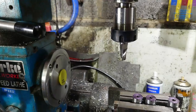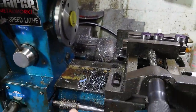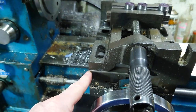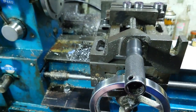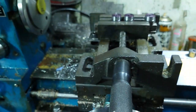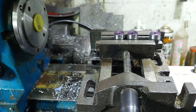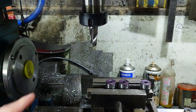If you're using one of these mills and you haven't used one before, make sure that once you've got it set up for the cut, you lock the axis that isn't traveling. I'm going to be traveling in this direction, so my carriage in that direction is locked — it's not going anywhere — because these lathes do have a bit of play and it will jiggle about.